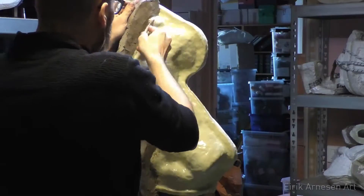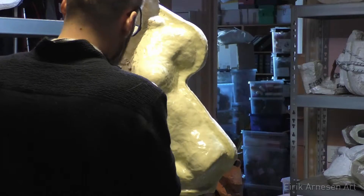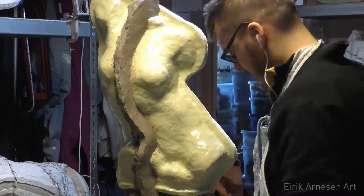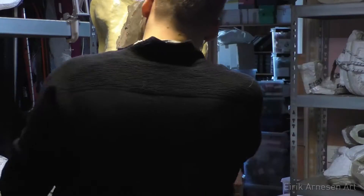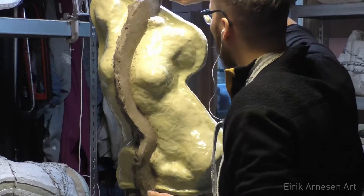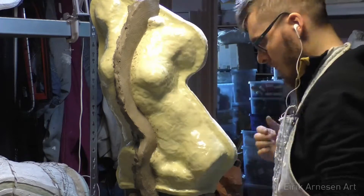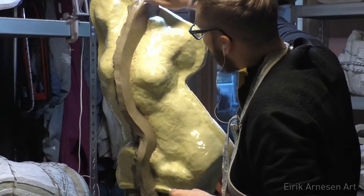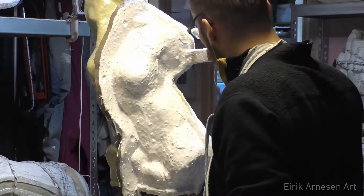To split the mold: the back half is pretty straightforward, but the front half has to be split in two as I explained in the last video. The back should come off pretty easy, but the front would get locked in because of undercuts. I solved the problem of these undercuts by building a clay wall, which lets me build two pieces on the front — creating a separating wall. The important thing is that it's tall enough so there's space to put bolts through to hold both sides together, and the surface should be pretty smooth since there will be two separate pieces of resin put together here.